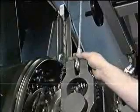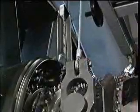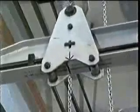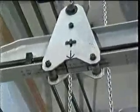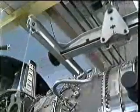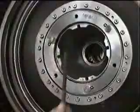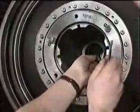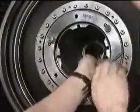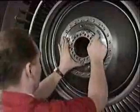Now release the tension of the lift sling cables, alter the sling center of gravity, and remove the sling from the module. Engage the curvic bolts with a long wrench and tighten all of them to finger tight. Fit the indexing unit to the fan stub shaft lugs.